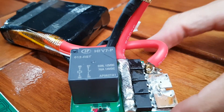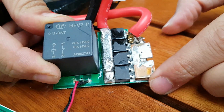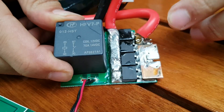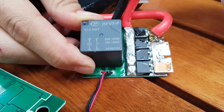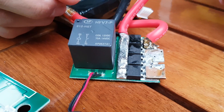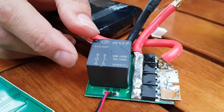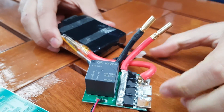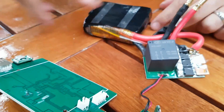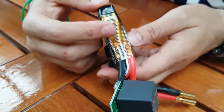Going back to the battery relay controller board — in this board there are four power rectifiers, each of them rated at 40 amps, and they're all connected in parallel. So for four of them, that's 160 amps. You might think, if it's only 160 amps, how do we get up to 1000 amps? It's designed to do a short burst for a short period of time — it can probably handle up to that level briefly. Now, this unit doesn't work anymore; when you connect it and try to charge it, it doesn't charge. I'm guessing something's wrong here, because there are also protection circuits at the battery level.